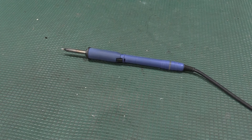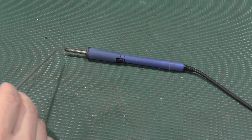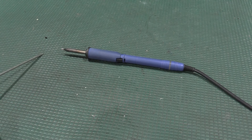Probably more importantly than the ergonomics of the soldering iron is what the heating element is and how well it does for tip control or thermal transfer. The whole act of soldering is to get the heat from the iron into the joint as fast as possible — so you can get in, wet the joint, get enough solder on it, and then get out as fast as possible without overheating the component or the pad or the board.